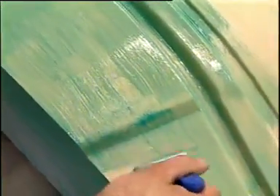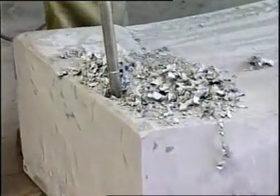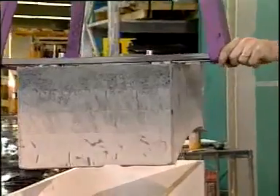After application of a PVA separation film on the wax foil, the now hardened tool core is first mechanically roughened to ensure optimal adhesion of the front layer cast, and then the casting and bleeding channels are drilled. The punch and the die are joined and prepared for the front layer cast.